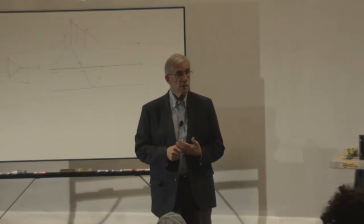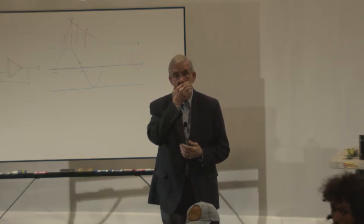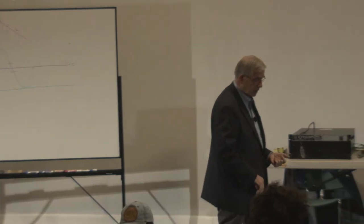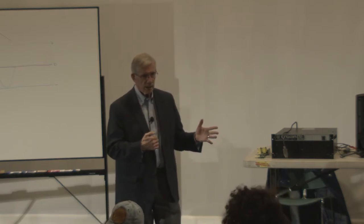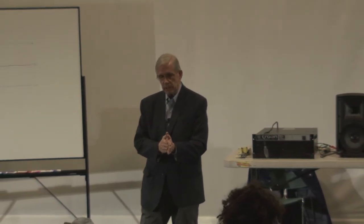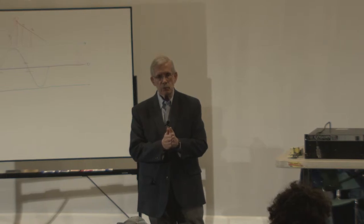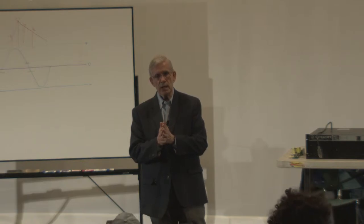Anything else? Anybody else have any questions? Aaron: does biamping increase efficiency in the amplifier as well as the speaker? Aaron pointed out that he used to do a demo at BYU where, as they ran the filter up, all of a sudden the amplifier stopped clipping. That's what's happened: most of the power being sucked out of it is in the woofer, so your high frequency amplifier doesn't have any of these very large draws, and is just very likely not to ever clip.